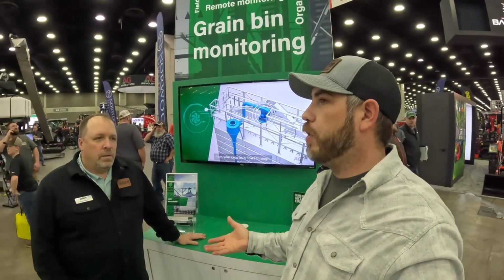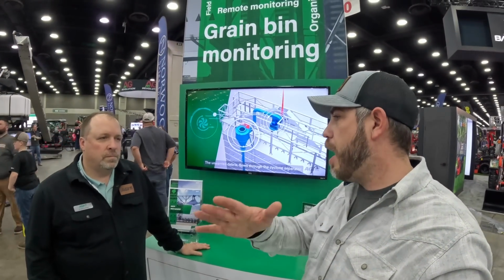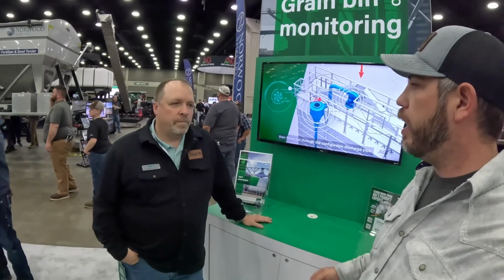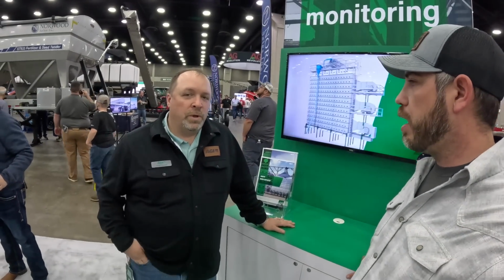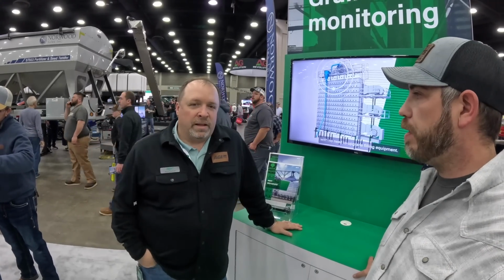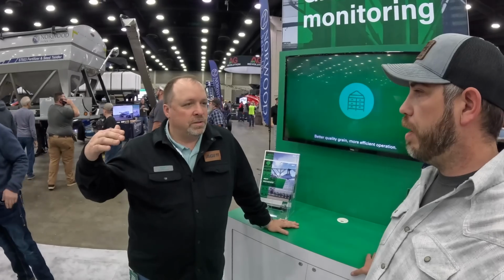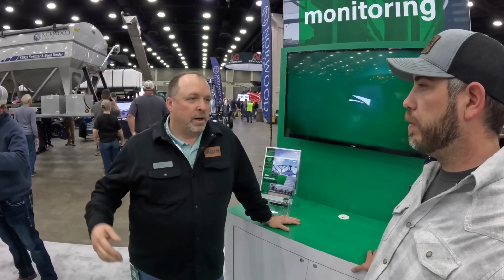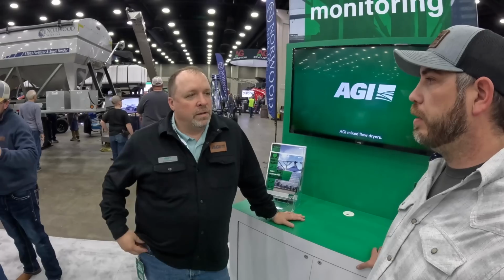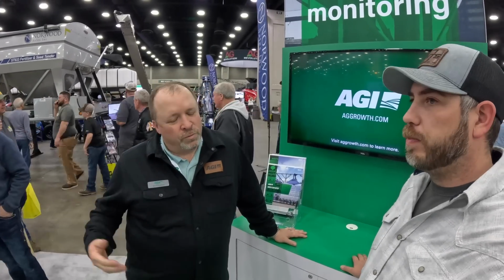So how about fan locations? We've had a lot of discussion about fan location. Bottom, side, pre-mixing air. What do you guys feel is the best? Well, we use off the side, off the end of the dryer. That allows us to have different cooling. We can cool in the bottom sections, or we can run all heat in that dryer. So it gives us the flexibility, depending on what you need to do with your grain and how long you run it through the dryer.